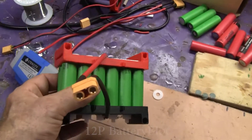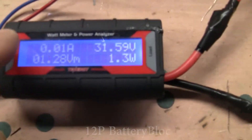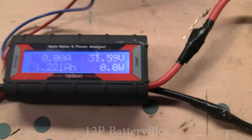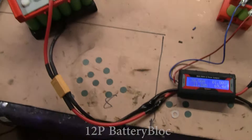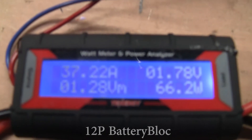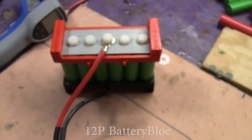Here's the 12-pack, built with some high-capacity cells. We're going to hook it up to this Tennergy — there's the amp meter, we're going to watch the amps. This battery block is powering the Tennergy since it needs more than 3½ volts to run. Here is the resistor bank that we'll be loading up. Everything is connected and we're getting 37 amps — that's plenty of power to run an e-bike or whatever else. 85 watts out of one parallel group.